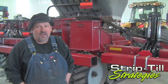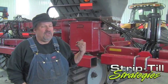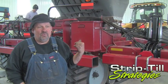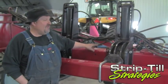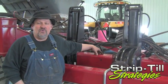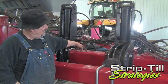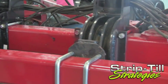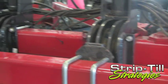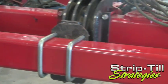It's Hammer Kavazanjan Farms and right now we're up here taking a look at what our modification is going to be on our strip-till bar. What we did is we reinforced the 7x7 mainframe with a 5x5 tube inside the 7x7 welded in. We notched slots in it and welded them all in to give it a little more extra strength. And we replaced the 7x7 3/8 wall with 7x7 1/2 inch wall.